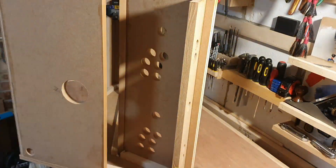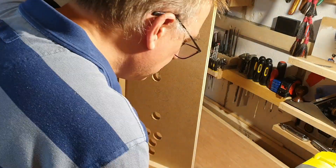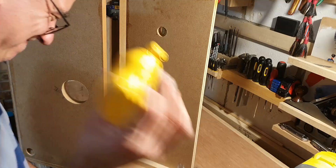Below the frame I've discovered one of the battens is a little too short behind the front panel. I'll take some planed wood shavings and layer it with glue to make some packing.